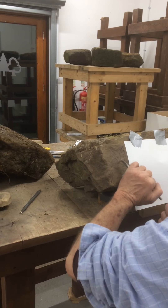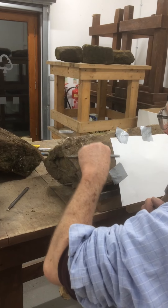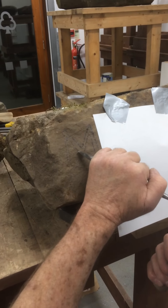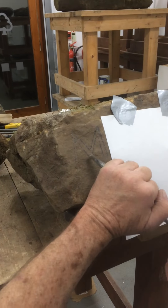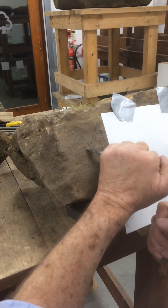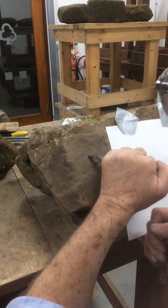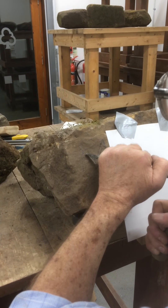Start in the middle of the letter. Note the way I'm holding the chisel and the angle — it's not like that or like that. Just using the tip of the chisel, we're going to go up the middle. Don't try and take too much away — almost just scratching it. It doesn't matter if you don't keep a line, just roughly in the middle.